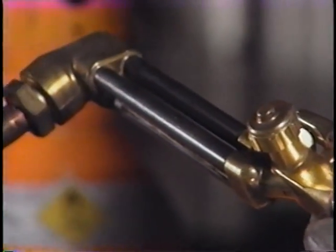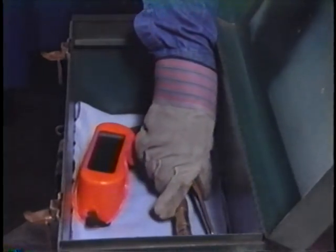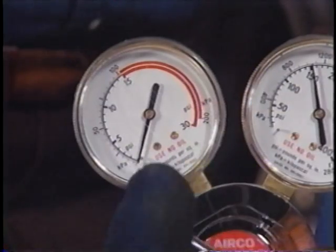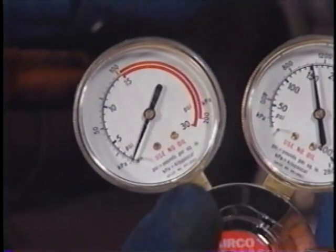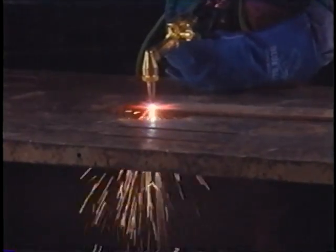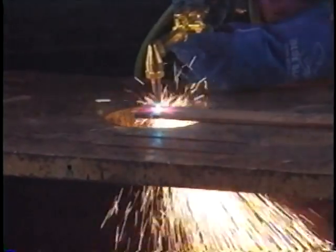If you put your welding regulators or torches into a toolbox, be sure that there aren't greasy fittings or greasy rags in there. If you should get some oil or grease in a regulator, don't try to clean it yourself. Send it back to your supplier for service. Don't weld or handle gas welding equipment with greasy hands. A greasy hand in a blast of oxygen can make a gruesome torch.